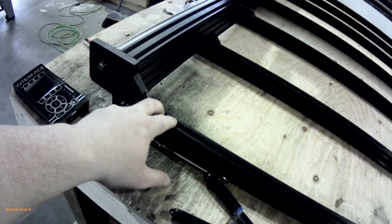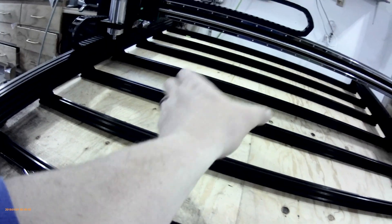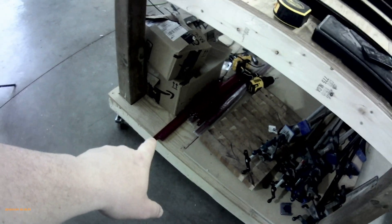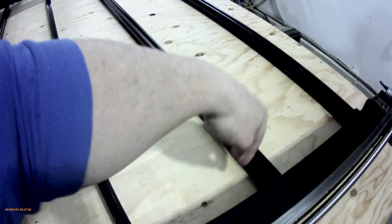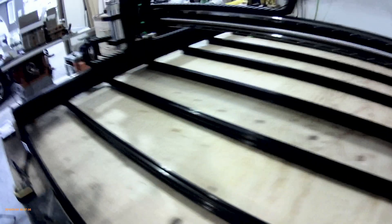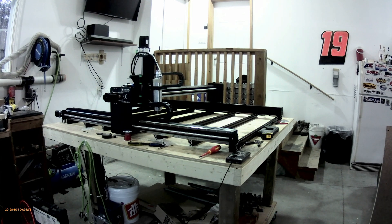I got my spoiler board cut. I'm going to mount it with drop-in T-nuts in the four corners — this one's going to stay on permanently. Then I'm going to have strips of another one on top, anchored with screws, and I'm going to have a sliding T-bar for clamping mounted on this one. I had to move it in an inch to make it so that what I cut for the spoiler board mounts perfectly. So we're going to get this mounted.